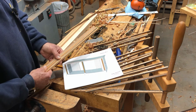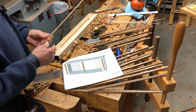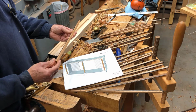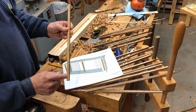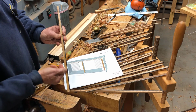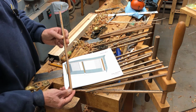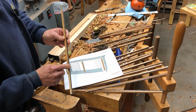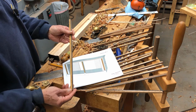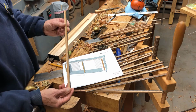So the way I made these, I cut a piece of mahogany. Here's a piece of mahogany. It's 3/8 wide and a little bit fat of 1/4 of an inch thick. And then I veneered that crotch cypress on top of that face, created a little rabbet in the edge, and glued in this piece of ebony stringing. So there's just a mess of hot-hide glue all over this, and it has to be sized now and cleaned up, and I'll show how I go about that process.